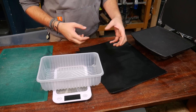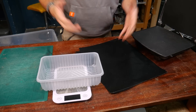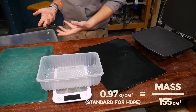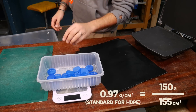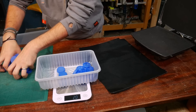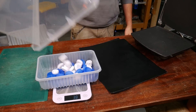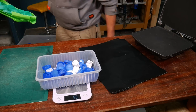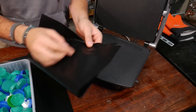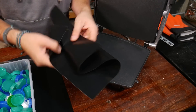We're going to try and keep it about three millimeters thick. If you work that out using a density formula for HDPE, you can work out we need roughly about 150 grams. So we're going to chuck a mixture of colors in here — we'll start with some blue, chuck in some white, and we also use some green.